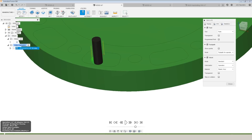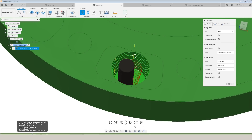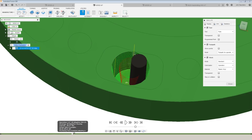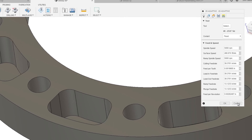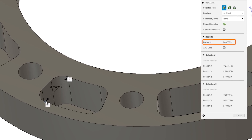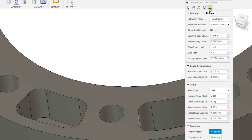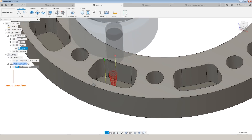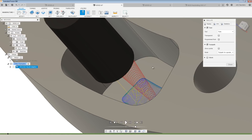When using the 6-degree ramp taper angle, we noticed a small post left at the center of the part, but it gets machined away as you ramp down — we've never had it be an issue, but let us know in the comments if you have. The helical ramp diameter is also the most common cause for getting an adaptive toolpath that just doesn't calculate. For example, programming a 2D adaptive to machine a 0.637-inch pocket with a 3/8-inch end mill should work, but you get an empty toolpath warning. The first fix: set the helical ramp diameter to something really small like 0.05 inches, and sure enough that resolves it — though you can't make it so large it crashes into the sidewall while ramping in.